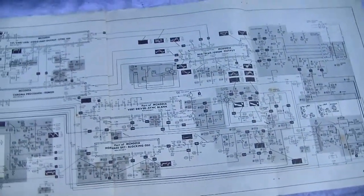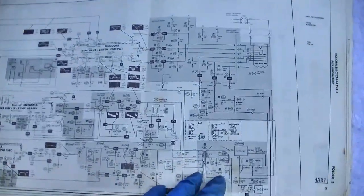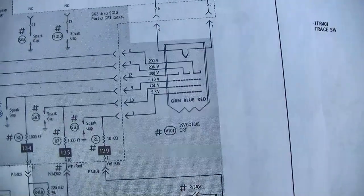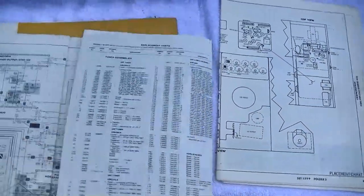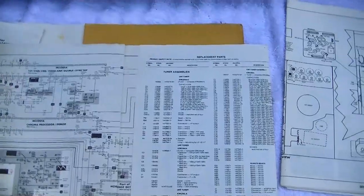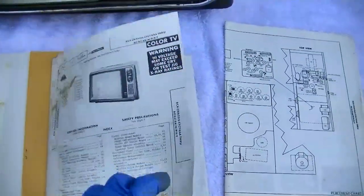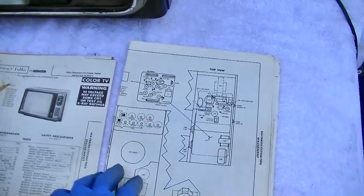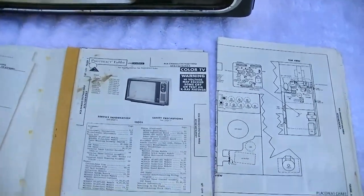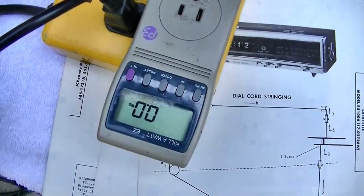I'm sure a lot of people who watch these videos have worked on these sets and are familiar with it. I usually only deal with tube stuff, so this is a little more modern. Anyway, I'm just going to brute force it — plug it in and power it up and see what happens. I don't want to try and bring it up slowly because some of these things in this era did not like low voltage and that could actually damage them. I'd rather have a capacitor short and pop the fuse than screw up those SCRs. I checked the CRT in the previous video and it was okay.